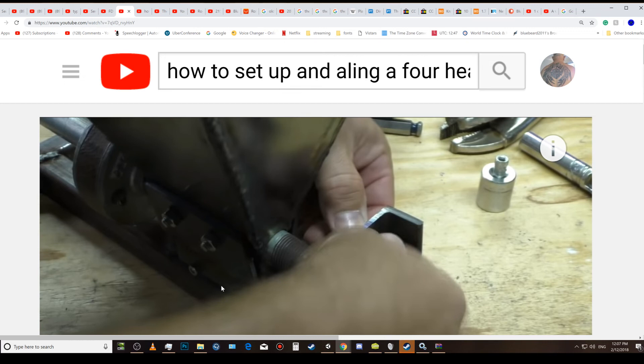I'll give you a tip on the motor — this guy has got a much better motor. It's a better thing because he can step it slowly and it's got a lot of force, because he's trying to push more product. The right idea — the only problem is he's got his hot end too hot and he needs to move his sensor back. It could take four or five attempts to get that sensor in the right spot to make a firmer plastic. You want the plastic at the stage of cooling by the time it's going through the extruder.